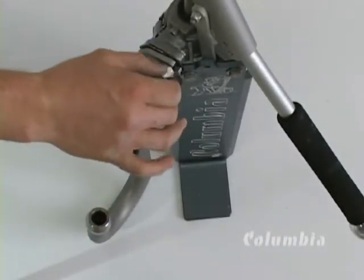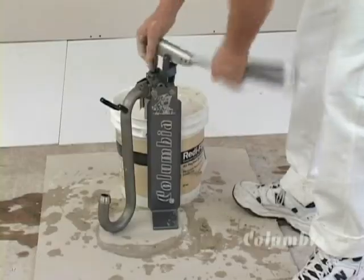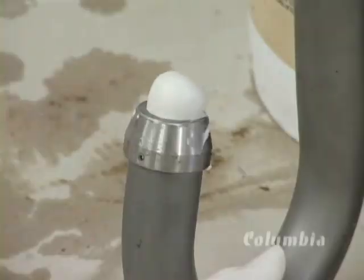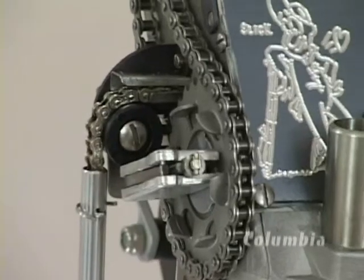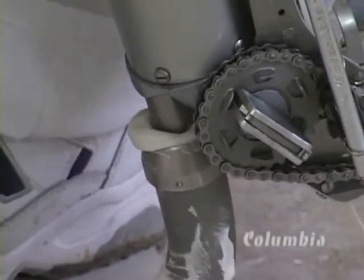The adjustable brake sets the desired tension and prevents the tape drum from reversing. Use the gooseneck attachment for filling the Columbia Taper. Pump the handle four or five times until joint compound is visible at the end of the gooseneck. This prevents air from being pumped into the taper. Push the mud gate lever down to the closed position — this closes the gate and releases the clutch. Insert the taper nozzle into the gooseneck fitting.